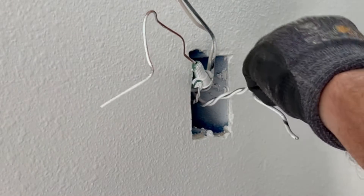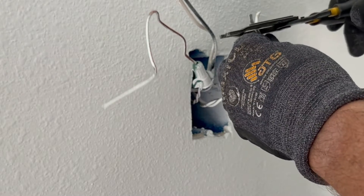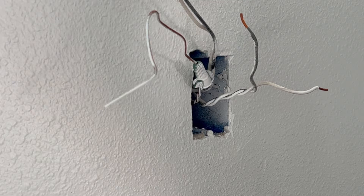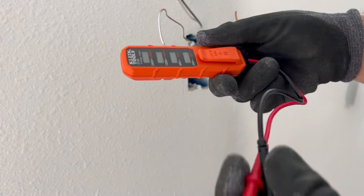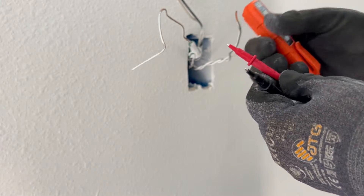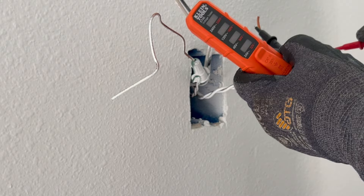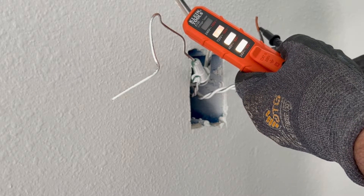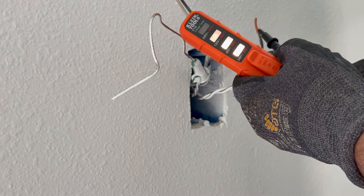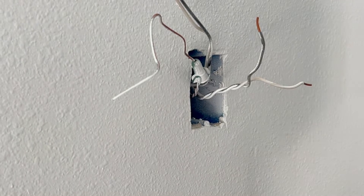So we had to identify which one's which. This one goes right to the panel. If you didn't know which one was which and it's connected in the electrical panel, you could take this — knowing that it's off — strip it if you think this is the line side. We have another handy-dandy tool from Klein. This one will give you a light if there's voltage. I'd like to test this to see if it's the right one. See the lights light up all the way up to 120 volts — starts off 24, 48, 120 but not 240. So this is in fact the right side, the line side. I'm gonna go shut it back off.